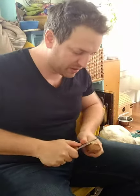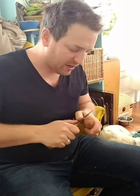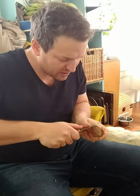So axing it out is really simple because there's no neck to worry about. So you basically just saw it to length and then away you go. Doesn't take very long. And the order of operations is the same as I do for my other spoons, in that I carve the rough outline that I've drawn first.